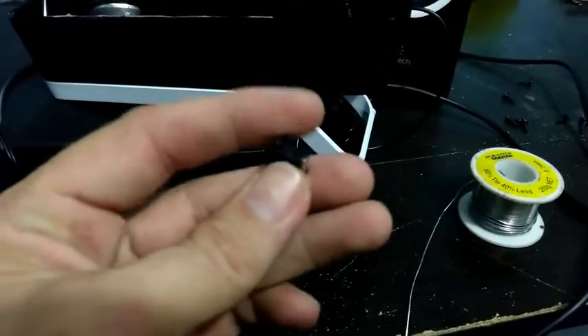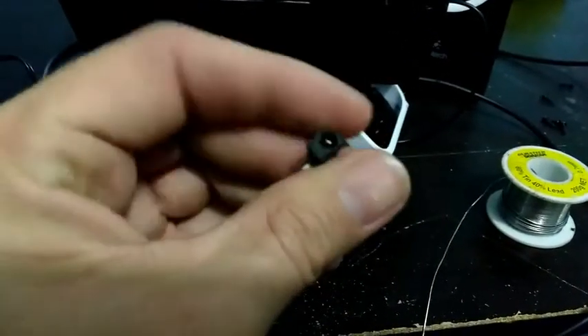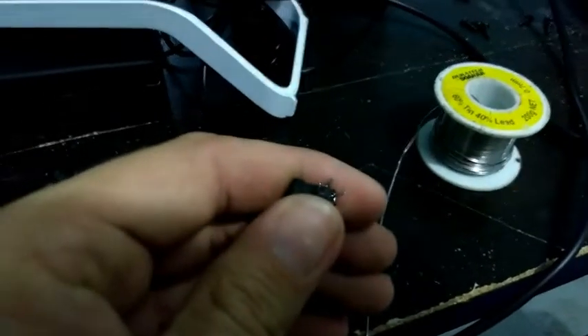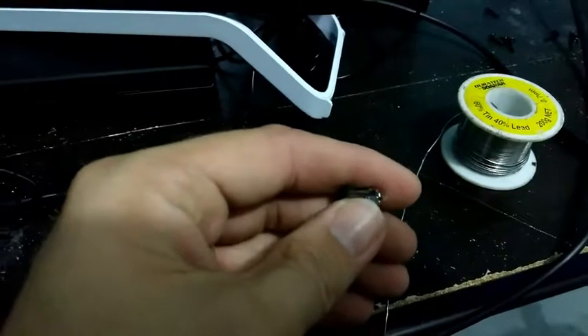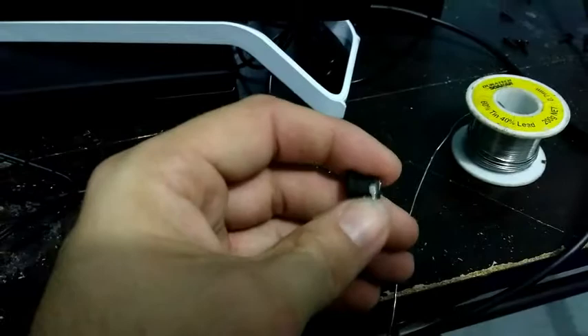What we're going to do is use that to remove those pins, work it out with my fingers. Now, by taking a look at this socket now I've got it off, we can see that the rear pin is the center pin, which in the speaker's case is the positive. You've got this one here which goes internally, and you've got two ground pins - they're both grounds. Pretty much what I'm going to do is put the red wire in the hole this back one came out of - that'll give us our positive. Then either of these two should provide us our ground.